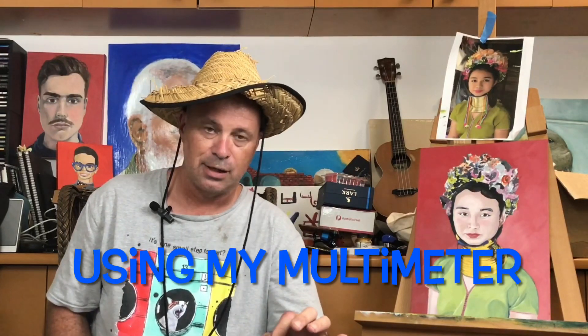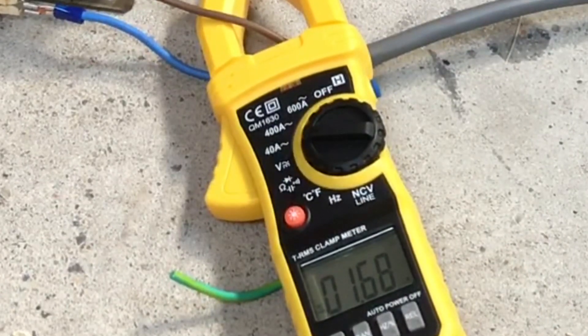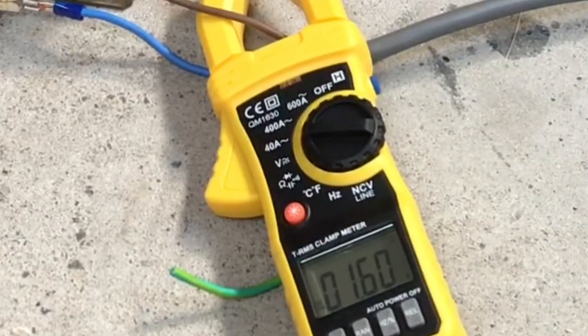This project has been about repurposing a microwave transformer for use in a linear power supply. I discovered that when measuring current on the initial transformer rewind, my current meter was having issues. The draw current was in fact 1.75 amps, which is basically what people said to expect, and the coil operates in saturation. I think I may have had a spade connector put on not very well, and I suspect the meter is dodgy. I'm being told this is drawing about 1.6 amps — starting a 30-minute timer now.